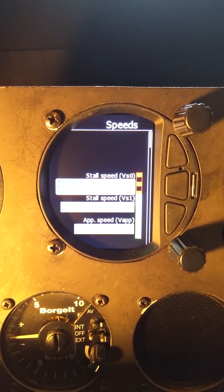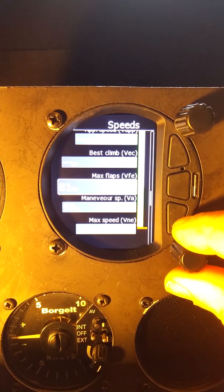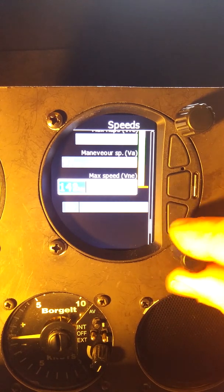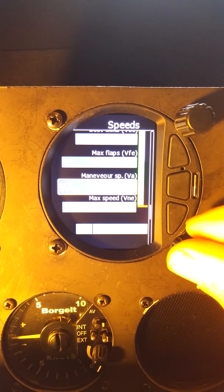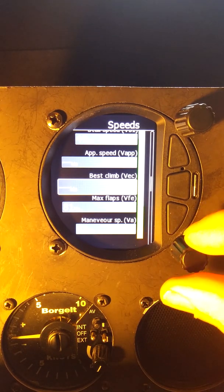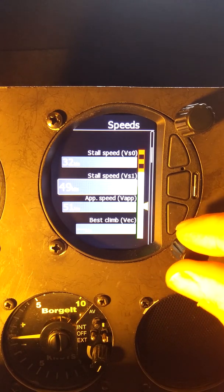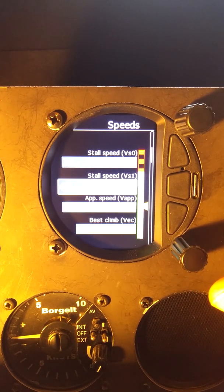You can use your flight manual and come up with those values. You'd go through and set your stall speed, approach speed — no flaps on a Jantar — your maneuvering speed, and your VNE. I'm going to set VNE here to 154. Maneuvering speed on the airspeed indicator looks to be about 82 knots, so I'll set that to 82. No flaps to worry about, so no blue line. Approach speed is the yellow triangle, and that is at 51 knots, so I'll set that at 51. Stall speed appears to be about 45 on this airspeed indicator. Those speeds have been set.